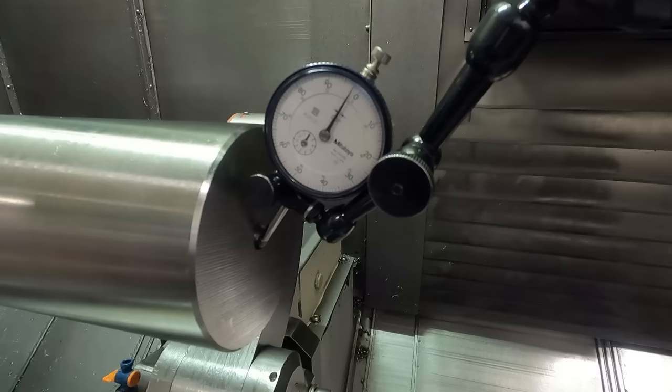So first thing I'm going to do is loosen these chuck jaws, and the part will tip back in the spindle, and it'll hit the end of the part on the spindle bore, but it's not dragging or hitting any of the OD of the part on anything right at the moment. You see how it tipped back when I loosened. I always loosen number one. This is number one jaw, and this is number four jaw when I'm dealing with this four jaw chuck, so that if I'm putting another part in, I'm not in this case, but if I was, then I would tighten these two jaws back up, it would be running fairly close to true to begin with before I indicated it in. So now I got those two jaws loose,